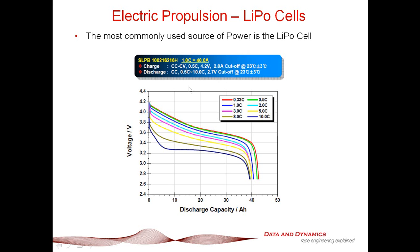As you can see, there are various colors for the amount of current you're drawing from the battery, and that's termed as a C rating. The smaller the C rating, the less the voltage drops. As we really crank it up to, say, 10C, you can see it drops off and levels off. Then as we start to discharge, pretty much it falls off a cliff.